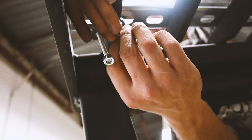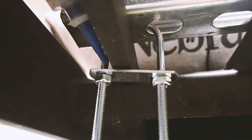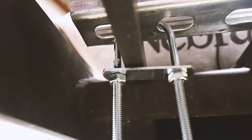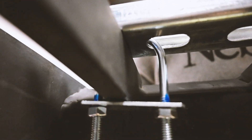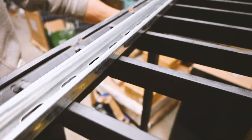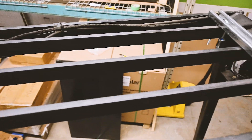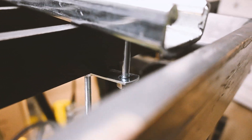What you do is just push the metal plate right up and hand tighten the bolts. We're going to do the same thing for all four corners and then start mounting the panels. Because it's going to be in a moving application, I'm going to put some Loctite on all the corners — this helps lock the screws in place so that vibrations won't loosen them. We've gone ahead and tightened all of the U-bolts across the strut channel — all four are nice and tight with Loctite applied.